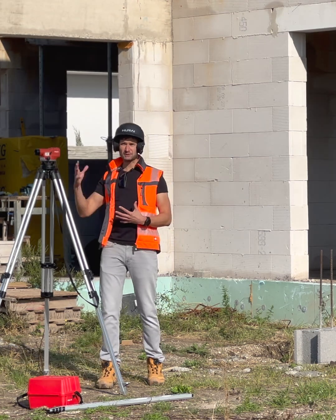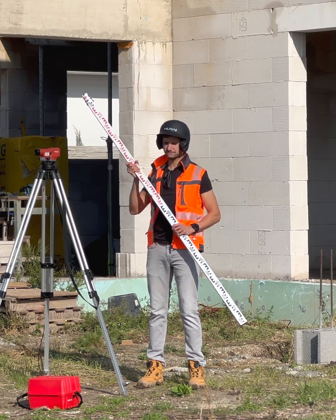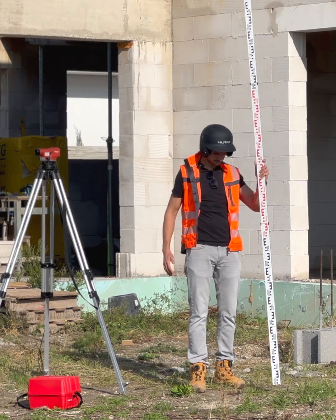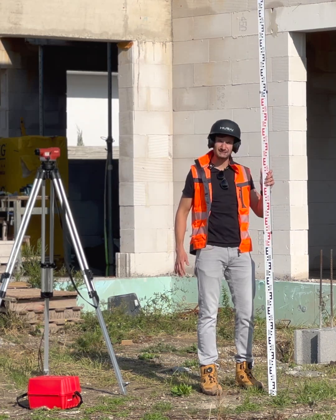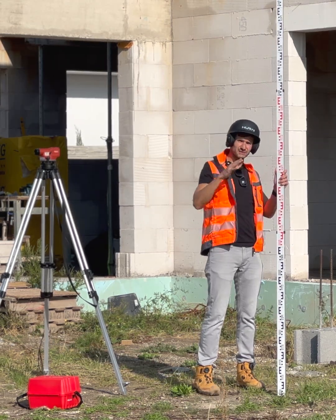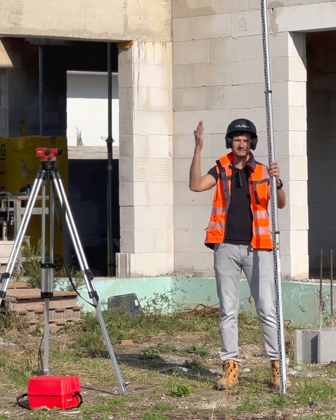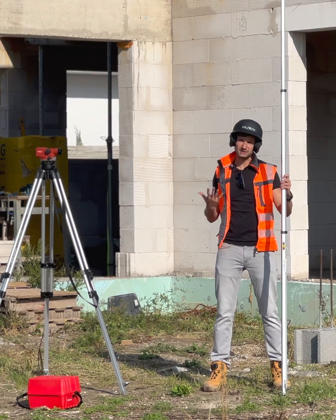And now on to using an optical level itself. Grab the leveling rod and extend it to the needed length. Let's say the geodesist marks at this point a height of 222.25 meters above sea level. You need an assistant to hold the rod at this point, always vertically to avoid skewed readings from holding it at an angle — you always want to read the correct horizontal projection value. Look through the device at the scale; let's say you read a value of 1.55. Write down this value and move on.